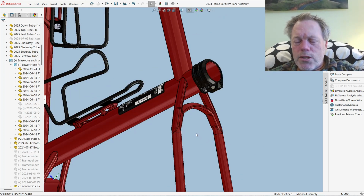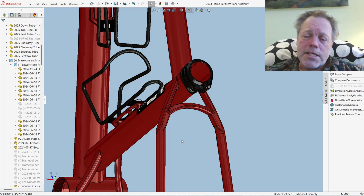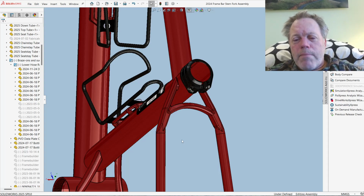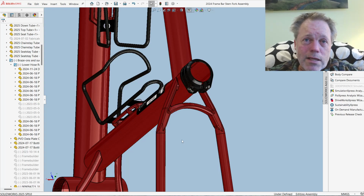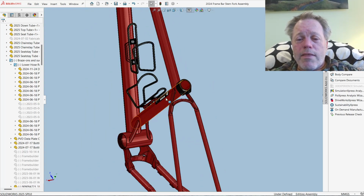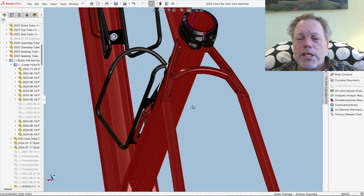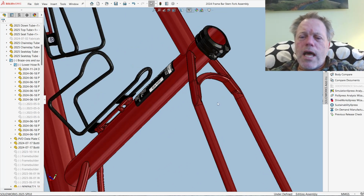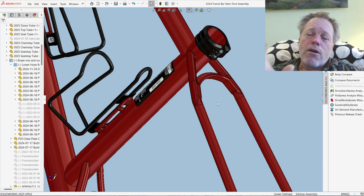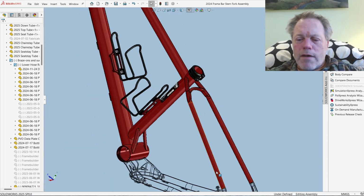But the clearance at this point is so good that, especially at my tire size, I think a big mistake people make with hardtails and short stays and things like that, you don't need a very big rear tire on a hardtail. I tend to use 61 millimeter rear tires. They're great. You can get them to roll fast, you can get them to hook up, but there's body clearance issues up here too. When you buzz your tire against your leg, that's not cool. And a reduction in tire width helps there. So there's a lot of huge gains with smaller or narrower tires. Real gains, especially if you low knob. The front can be big pokey knobs and big tire, whatever you want to do, but the rear, tone that stuff down. It's going to help you roll. It's going to help you move around the bike. That's all good stuff.